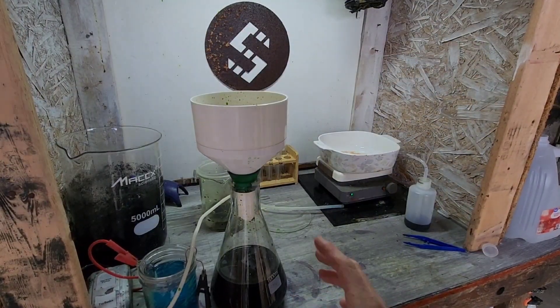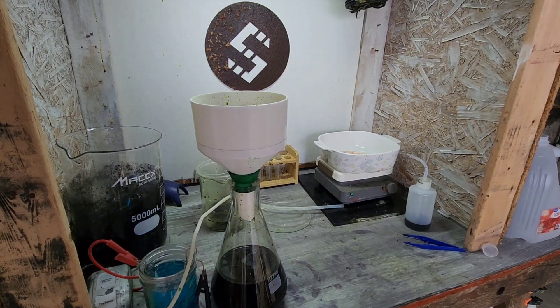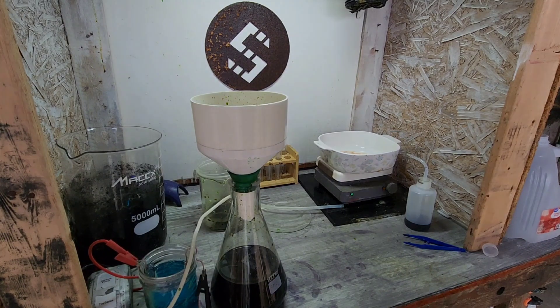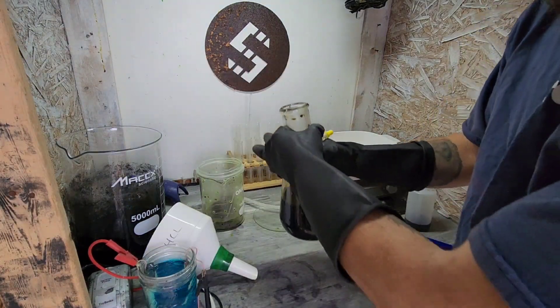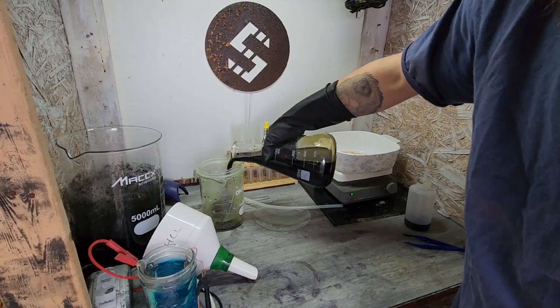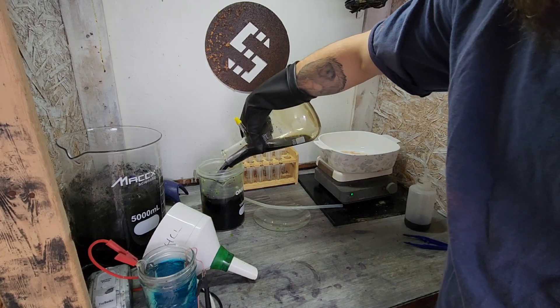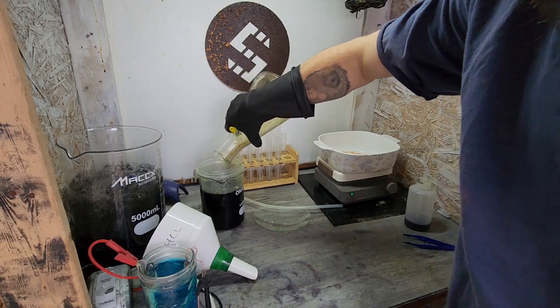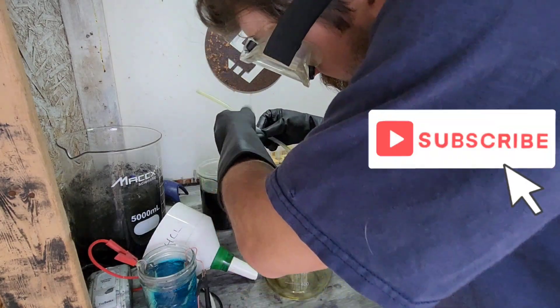We're done filtering out. What I'm going to do — to avoid diluting the solution — is go ahead and pour the solution back off, because I want to rinse off some of the base metals before we go to Aqua Regia. Pour this back in here and get it started again.